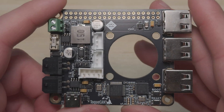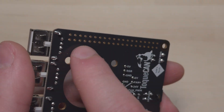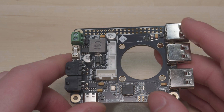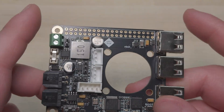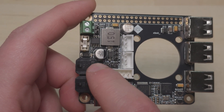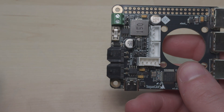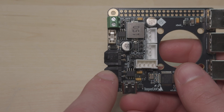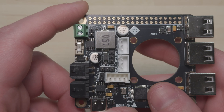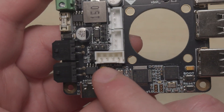The idea for this started with the Toucan, which I released about a year ago — I think it was April. This is a Raspberry Pi Toucan — technically not a HAT, but imagine there is a female header on this side so it sits on your Raspberry Pi. It powers your Raspberry Pi from 24-volt power input, has three USB outputs, and also has a CAN transceiver for connecting CAN devices — for example in an IDEX configuration, with one tool head connected here and another connected here, following a U-shaped linear CAN topology. The idea for More CAN started with this.